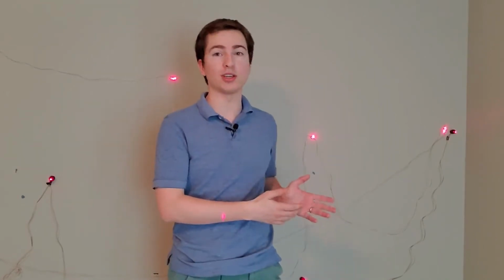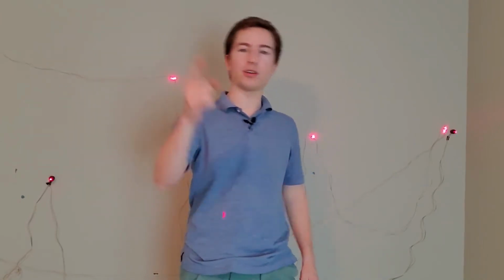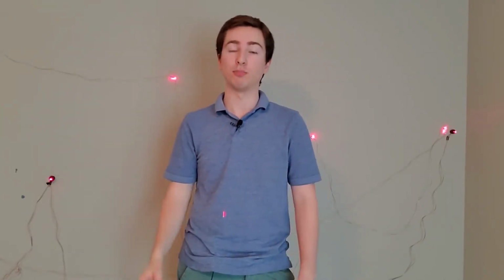To overcome the diffraction we were seeing in Revs 4.2 through 4.8, we now have multiple diodes and multiple photocells. So instead of having one diode go from one wall to the next about 4 or 5 times, we have it going from one wall to the next and coming back, and that's it. So the beam should be much cleaner. At the start of this project, I thought it might come to that, because that's what a lot of commercial versions of laser mazes do. Always assume that people know more than you.